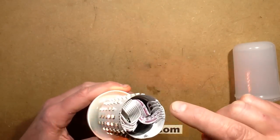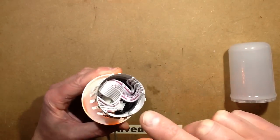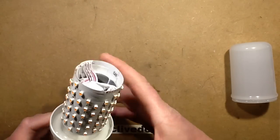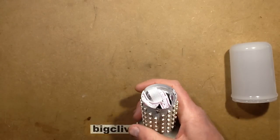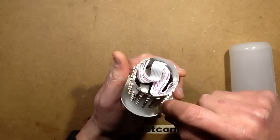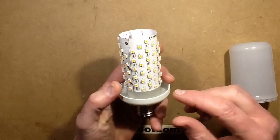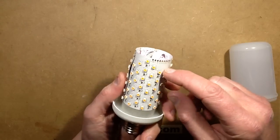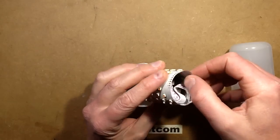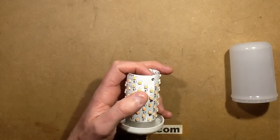The panel is kind of wrapped round — it's got lots of ribbon cable connections attached on either side. It's a flat panel that's been folded round and then screwed in. I'm going to unplug this since I don't know whether it's going to be mains voltage or low voltage — I'm guessing low voltage. The centre of the light is an aluminium core that extends from down at the base, where it's either resined in or hot-melt glued in, and it extends up to about here. There's also double-sided tape, so let's remove some screws and take a look inside.